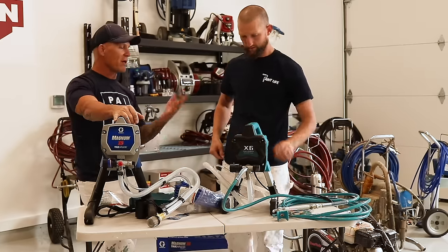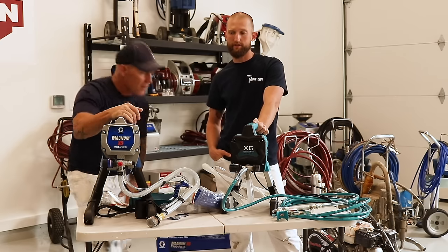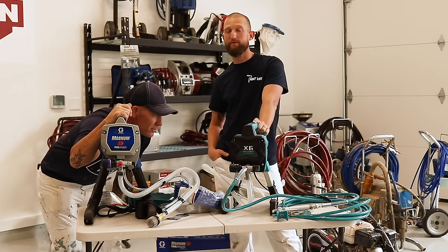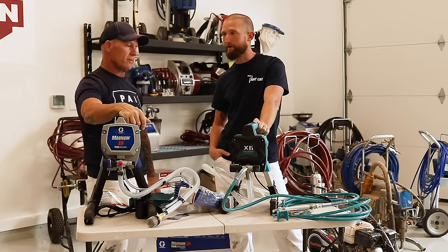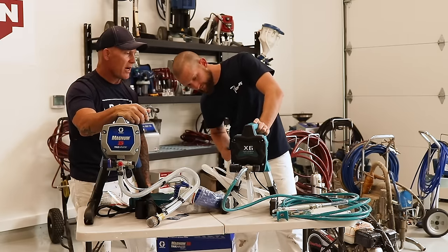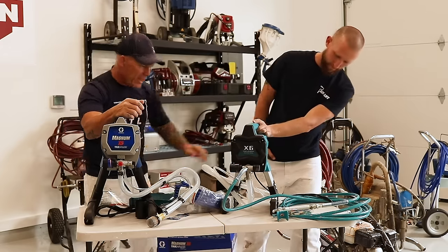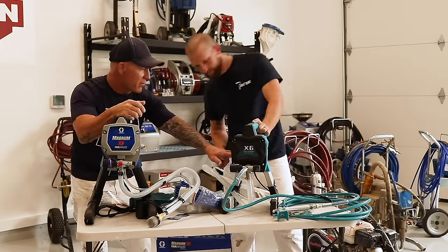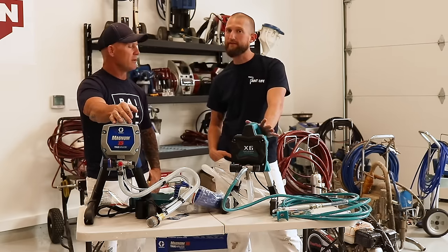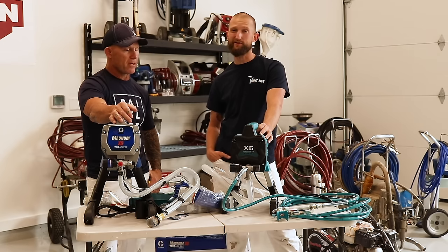It only comes with 50 feet of hose. Do you think you could run any more hose than that with that little gizmo? You just keep losing more pressure. I really think you could throw another hose on there if you really wanted, but only if you're using like a 310 tip or 410 tip, something along those lines. It has a whole bunch of numbers on here — that must be Chinese or something because I'm not sure what they're referring to. But that might be the tip size, so it says it could run a 519 max. You could push paint through a 519 with this, it's just not going to be pretty and you're going to do it once.